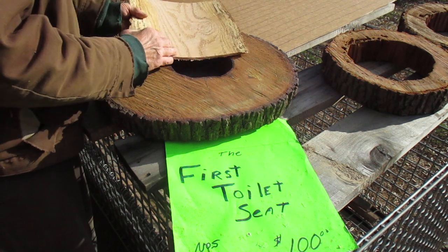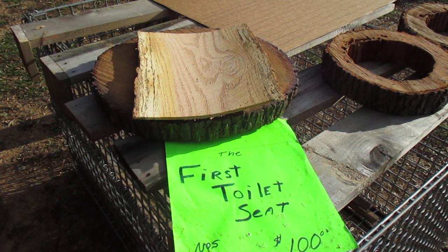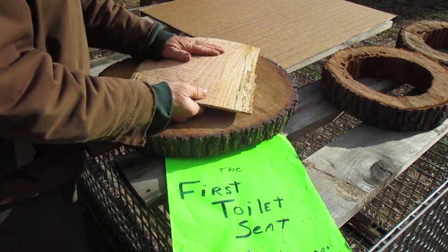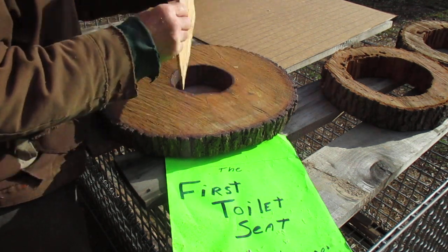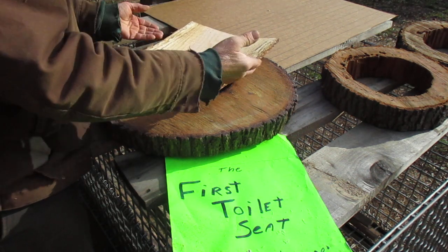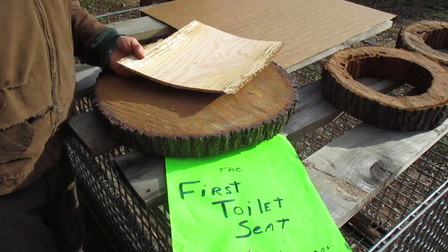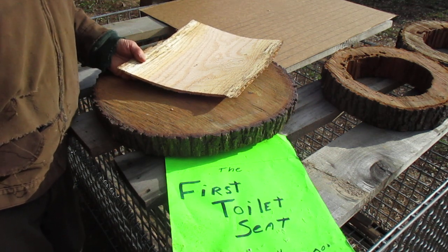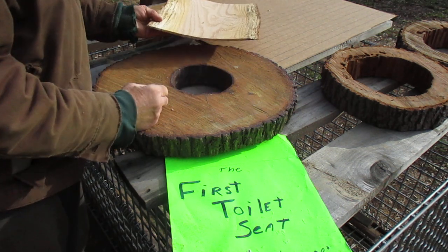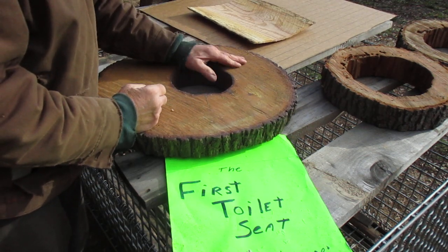Here's what I'm saying - I just saw this sitting out in the sun today, it was just a piece of junk wood that I cut. It was sitting in the sun and it's bowed. If I turn this over - this was wet a little while ago when I picked it up, it's already started to dry and started to flatten. But the sun's been on it and dried the top and consequently it's pulling it up. That's why on the side of my barn, when it rained all the boards were flat and now the sun hits it and they're just starting to bow again.